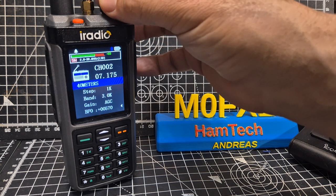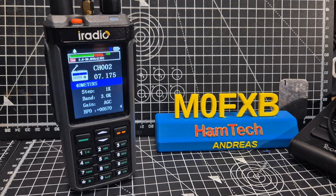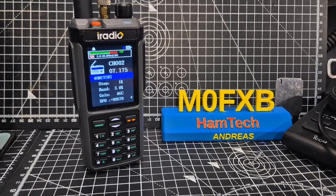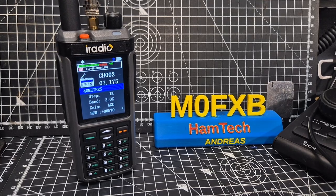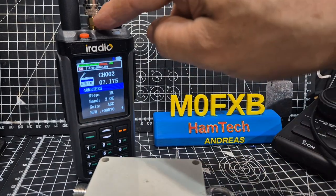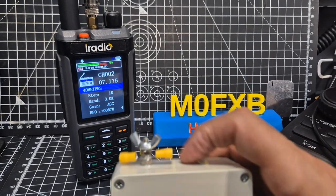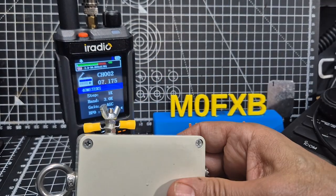The antenna in the middle is just a long wire with a 49-to-1 balun at the beginning, and the wire is 66 foot long. I know it sounds crazy, but you can make it out of garden wire — it's not expensive and it takes minutes to make. You can buy the balun; there's one here, this is quite a big one but you can get small ones. You just basically put the patch lead here to the adapter, which you can buy on eBay and Amazon, and then you connect your wire where the butterfly clip is.